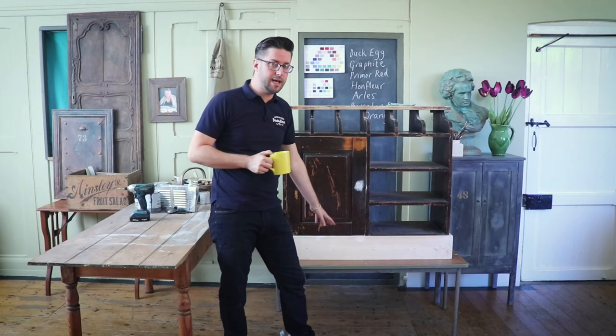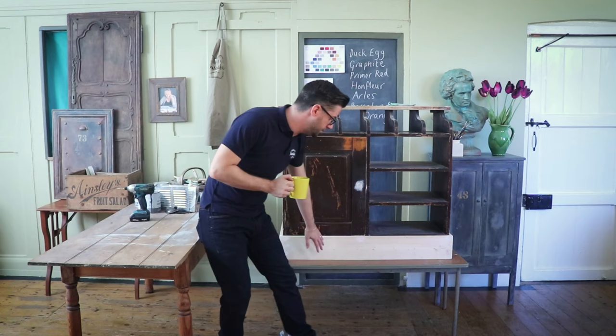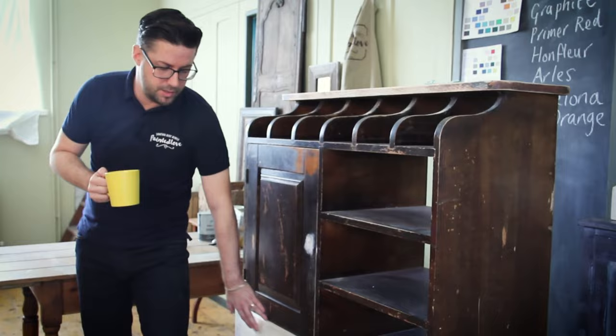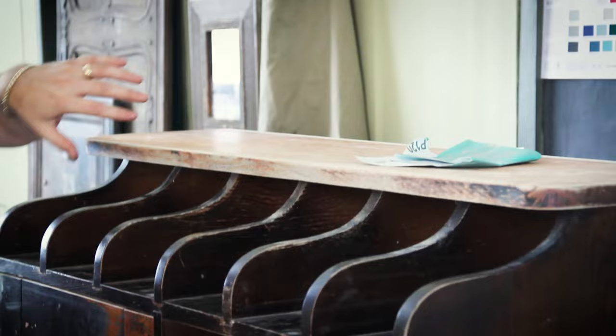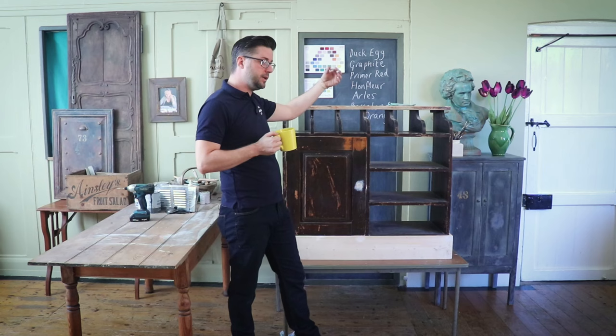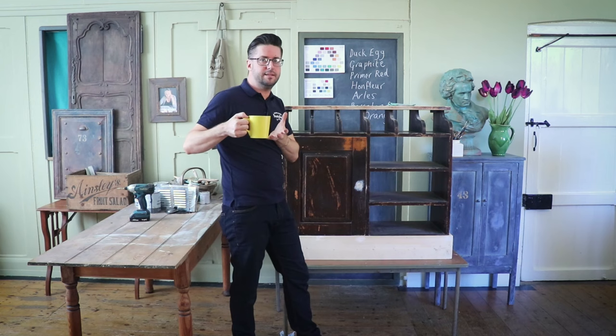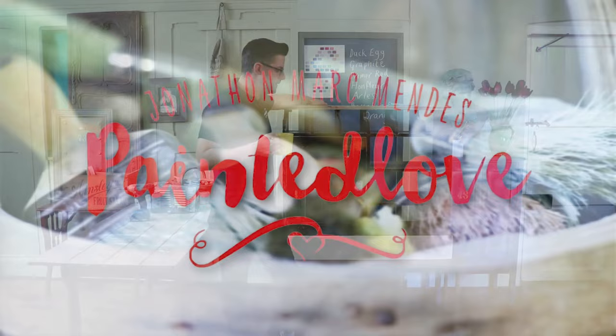The base of this piece had some damage. I've decided to quickly knock up a new base, framed out of a cheap piece of pine. I'm not going to worry about the colour because it's going to have a lot of paint on it anyway — that's why you're seeing a real different colour in timber at the bottom. I've also removed the back of this piece just because there's a lot of different cubby holes that we need to get paint into, so we can paint from back and front. A lot of bureaus have this where you can unscrew the back and paint the inside much easier.